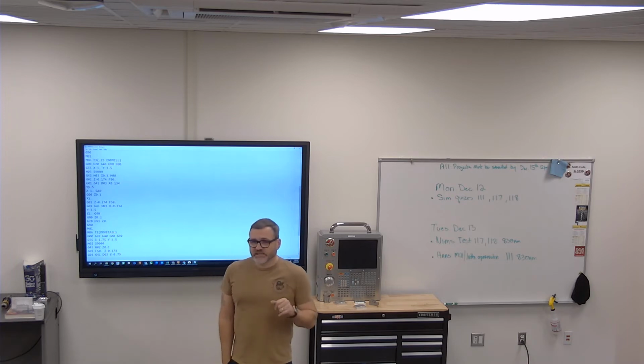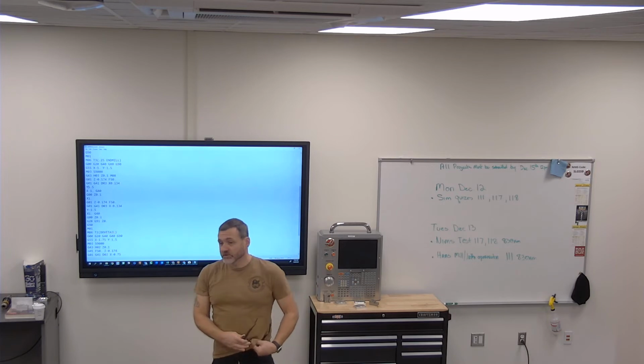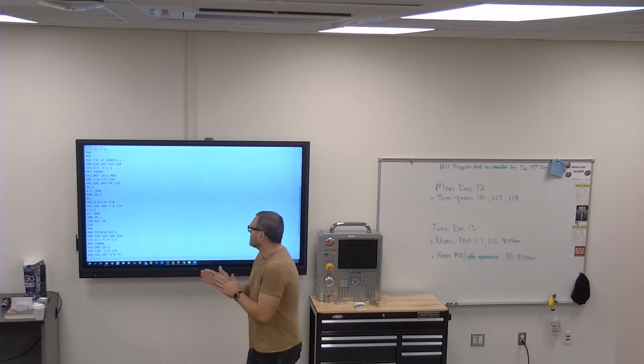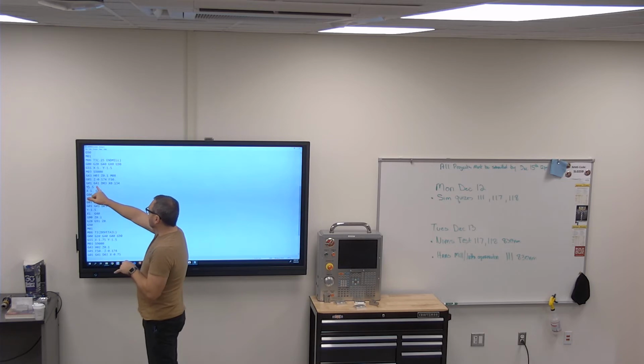On the CNC mill, conventional cutting is not conventional at all. On a manual machine, it's primarily your cutting method. We're going to climb cut, which means your cutter is going to stay on the left-hand side almost all the time. Okay, so you turn cutter comp on, you do your moves, you turn cutter comp off.